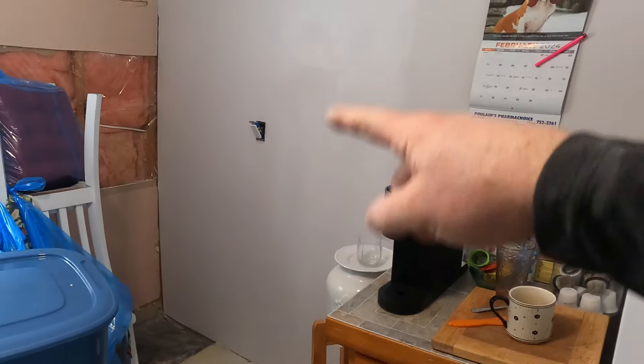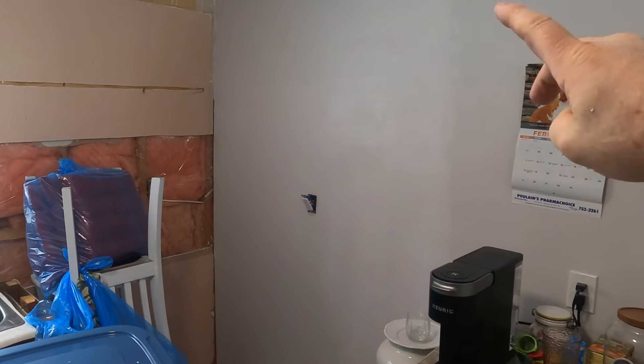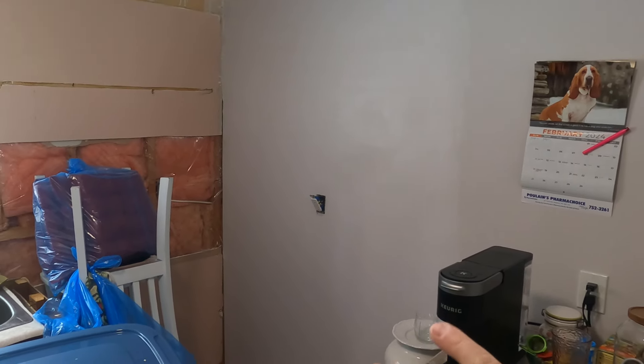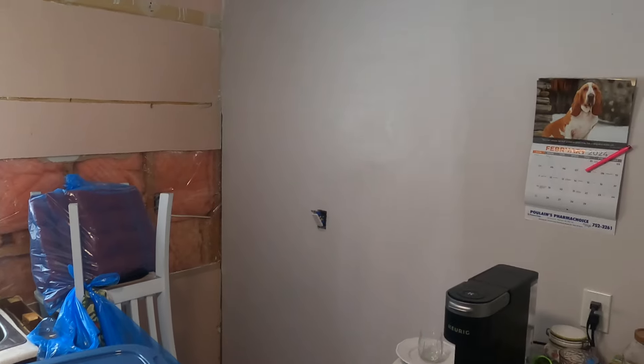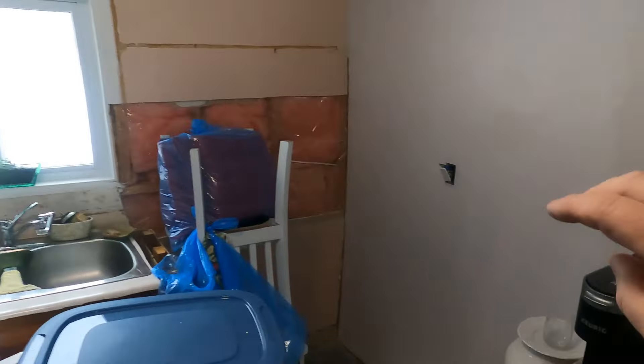I plastered the drywall down below. When you've got a lot of drywall and patches everywhere, it's hard to see the actual divots and places that need work. I like putting a coat of paint on first — it takes away the distraction of different colors and you can see the actual holes, scratches, or notches that need to be filled.